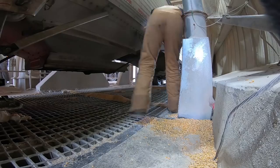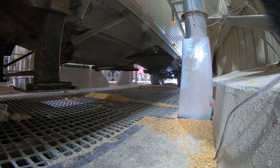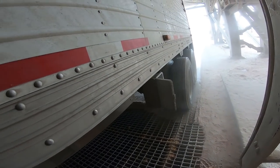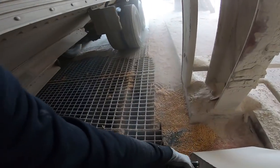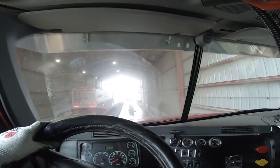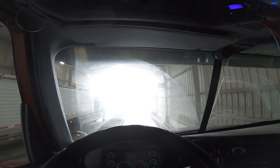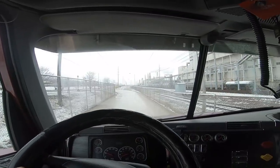Now I dump. Always dump your air suspension in your trailer when you're dumping on a pit that you can open all the way, otherwise you'll blow your airbags. The process is essentially the same everywhere: get your test, get your weights, dump your hoppers by turning the cranks to open the traps, then get out. Pull on the scale, get your outbound weight and your ticket, and then at this place you can leave. Go back and get another one — rinse and repeat.